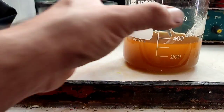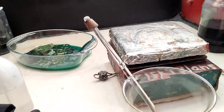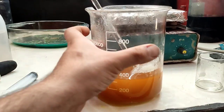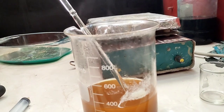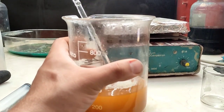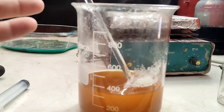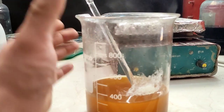Something strange occurred — my dropped gold redissolved. I was processing a board nearby to dissolve solder and extract possible silver, and nitrogen dioxide fumes coming out of that solution caused the dropped gold in this solution to redissolve. Surprisingly, only the presence of nitrogen dioxide brown fumes in this environment caused the gold to redissolve. That was pretty strange. This is good information to prevent gold loss: do not leach metals with nitric acid in the same area when you are dropping gold. Otherwise you will lose gold.